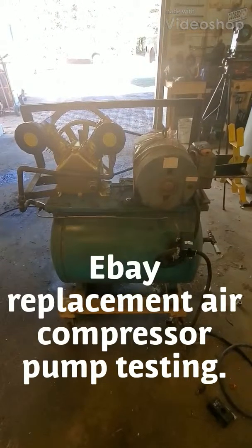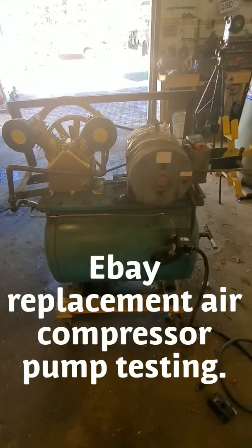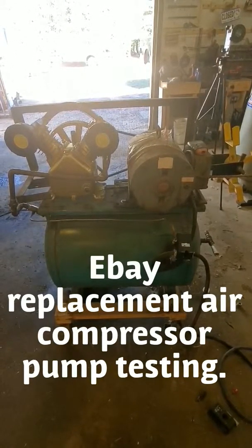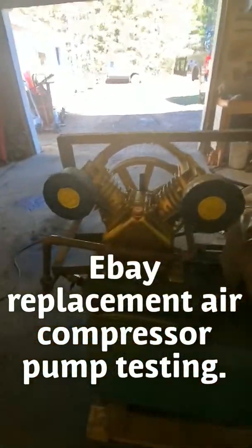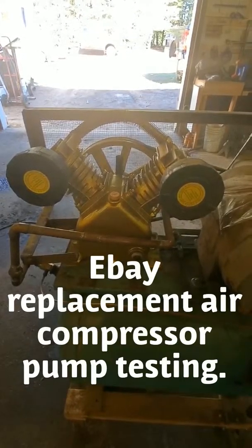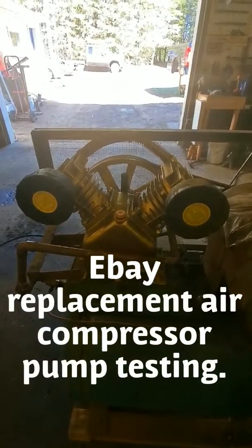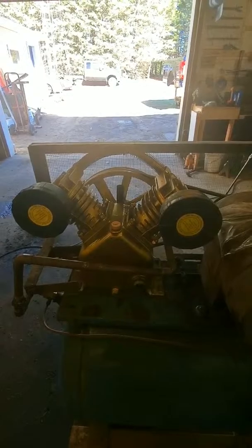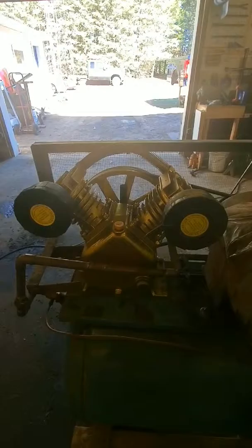Last night I did a video where I calculated the capacity of the tank, the RPM, and the wheel size. It's a 40-gallon tank and I'm running an Amazon/Harbor Freight-style two-cylinder V air compressor, supposed to be 17.5 CFM. I'm suspecting that's free air — I calculated it's probably going to be about 15.4 CFM at 90 PSI if I was spinning at full speed at 1100 RPM.